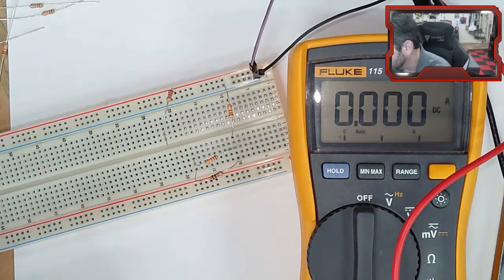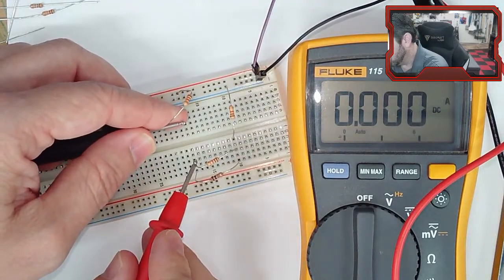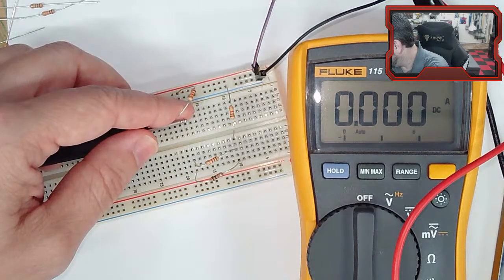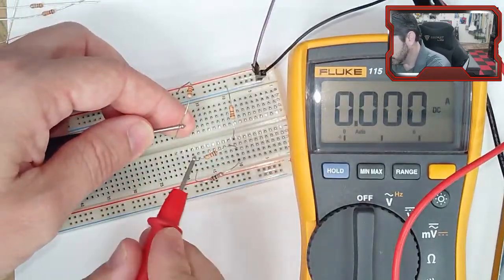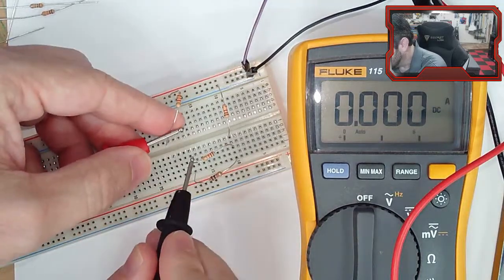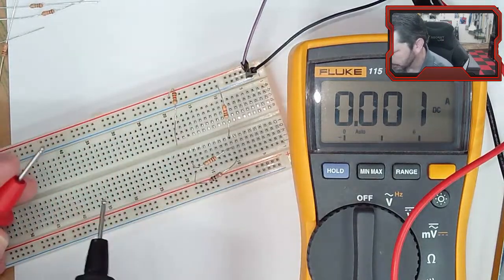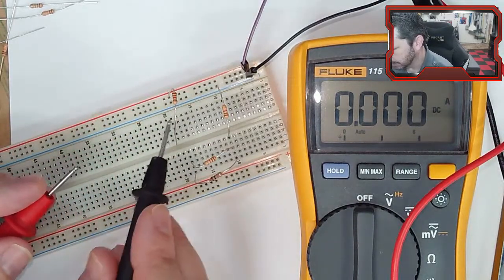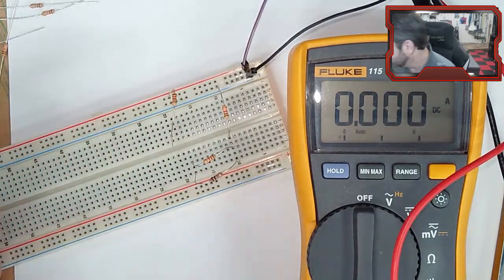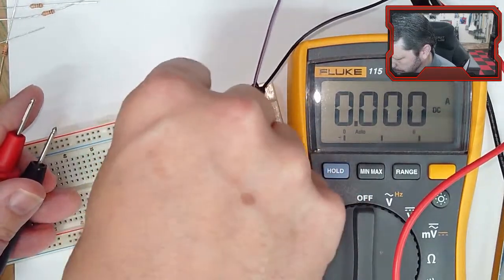There's no voltage on right now. Let's turn something on so we get some kind of measurement. My power supply is protecting itself here and not providing anything. But normally you would have to put the leads of the multimeter in line with the circuit, in series with the element that you want to measure. So you actually have to take it apart. I'm not going to get any measurement off of this particular thing right now, because it's not going to send infinite current through there.